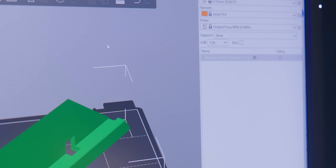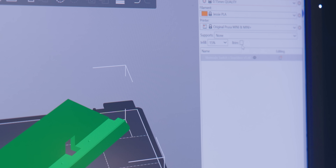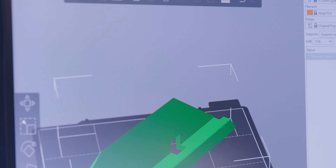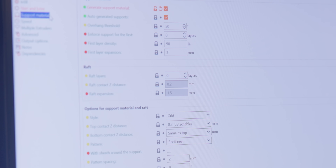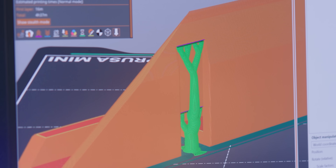I would consider this to be an extremely easy entry-level 3D printing project if you ever wanted to get into 3D printing. All the files are in the description below, and I'm walking you through what other stuff you need to put this together. I used pretty much the basic settings in my 3D printer software — I set it to quality, added a brim so it sticks to the bed easier, and enabled supports only where the build plate is. I changed the supports to organic because they usually work better than regular supports. It's designed to print very easily.